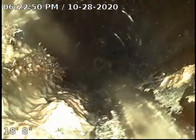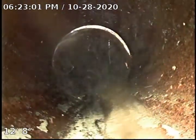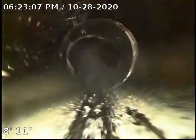The line as of right now is 100% due for hydro-jetting. I highly recommend to hydro-jet the sewer main line over here, and then re-run the line with the camera to verify and expose all the issues that this line has, and explore all options of repairs, whether it's a liner, trenchless, or excavating the ground and replacing the entire line with newer ABS plastic.